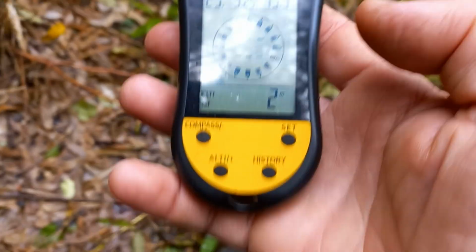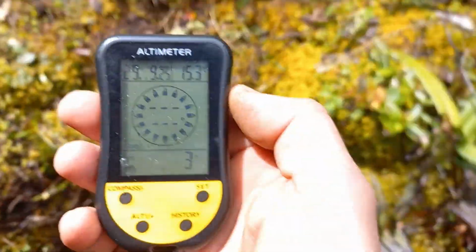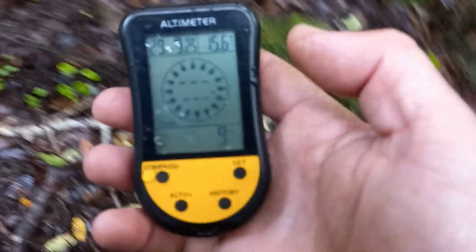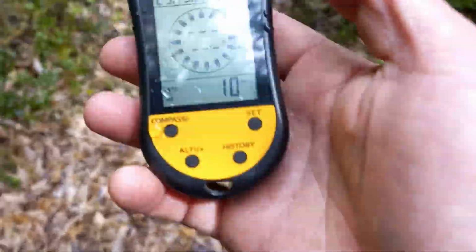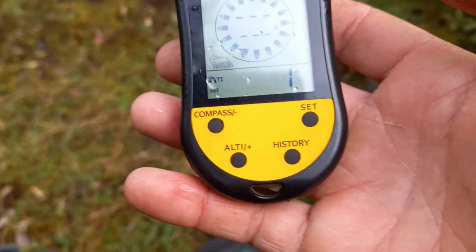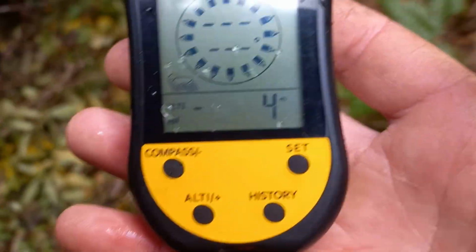Okay, here we go. So as I go up, the height starts climbing. I'm climbing to 4 meters from my 0, and keeps going up. So to be sure, what I do is measure in one way and then in the other way. When I go up, I measure, and then I put my 0 again, and I go back down, so I can have the correction if I need to correct my numbers. So I'm getting back to the place. I have maybe 3 meters of difference. But the weather is not that good today, not that stable.